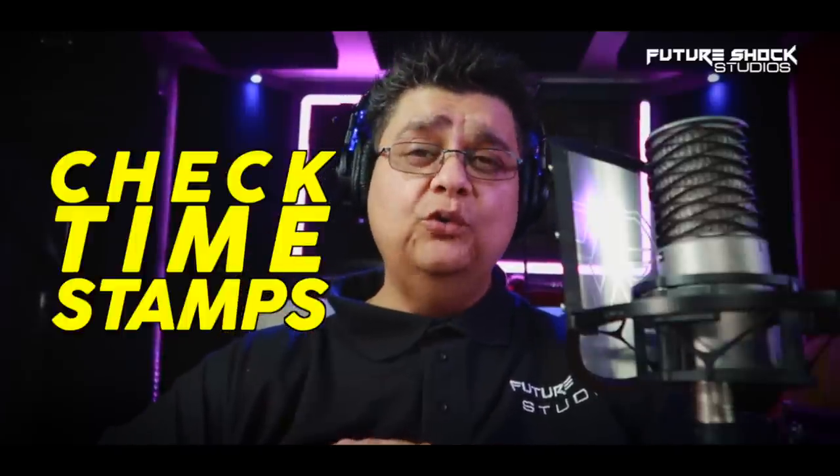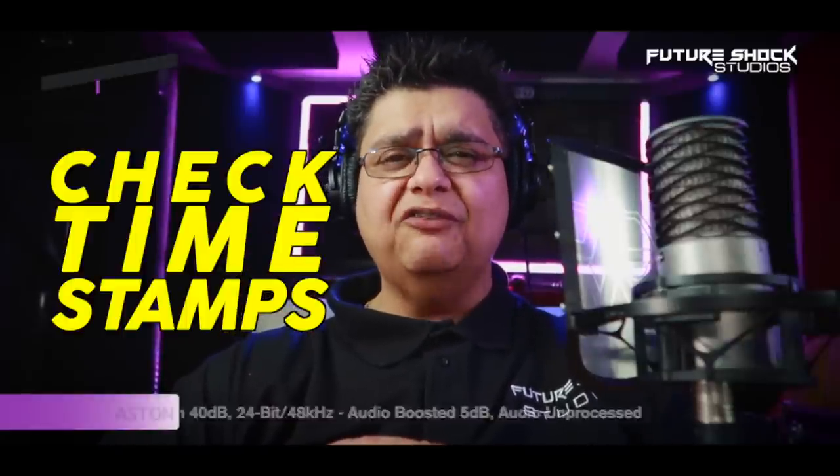For this review, all the audio that you're going to be listening to will be coming from the Aston Origin. I've got the mic plugged directly into my Apollo Twin X with 48 volts of phantom power engaged. My gain is set at 40 decibels and I'm recording in 24-bit 48 kilohertz. And you are listening to the raw and unprocessed vocal, meaning it's all natural, there's no EQ, compression or any type of noise reduction. But I may need to boost the audio a little bit later in post.